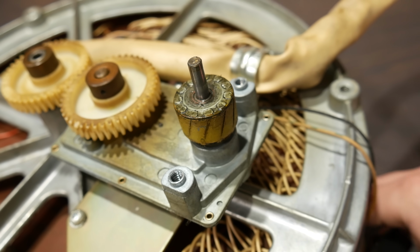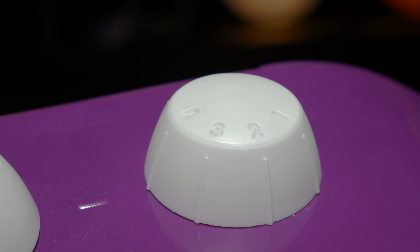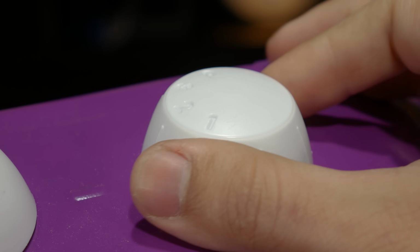But the amount of starting torque you get depends on what speed the fan is set to. The different speed settings are usually accomplished with different windings within the motor that produce varying amounts of power, and thus torque. And since the shaded pole affects all the windings equally, on lower speeds you get proportionally less starting torque. Making the first selectable speed high will ensure that the motor will, at least briefly, produce the maximum starting torque it can whenever it's switched on. That way it's more likely to successfully start.